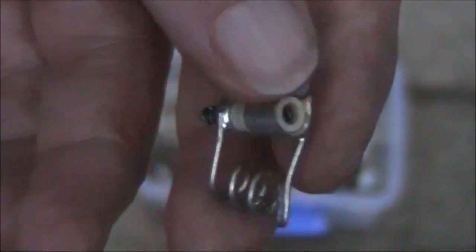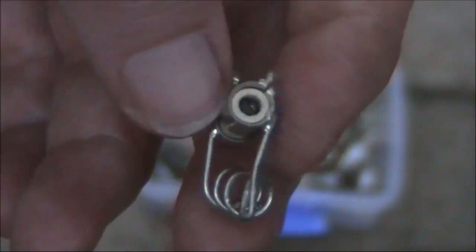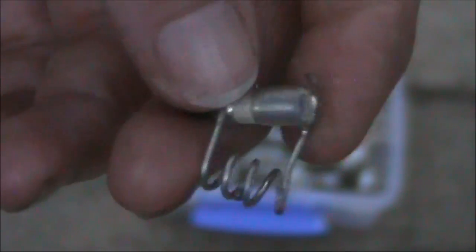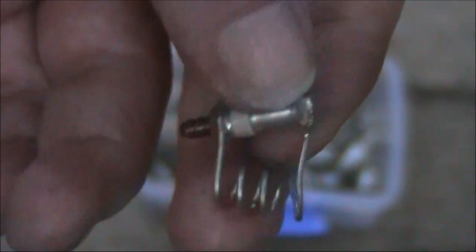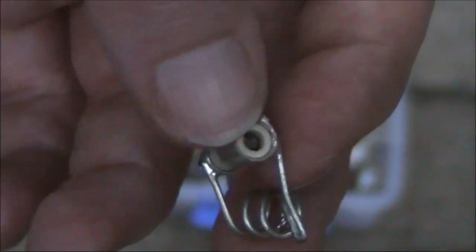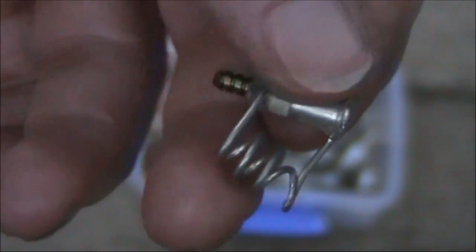This is also from a piece of VHF radio equipment. I would say its maximum capacitance would be quite low, maybe up to 10 picofarads, and there's quite a small inductance in parallel. Something like this would be OK for the VHF high band, maybe even 2 metres.